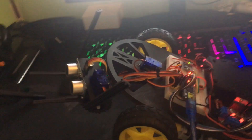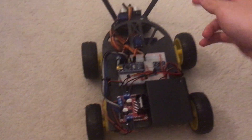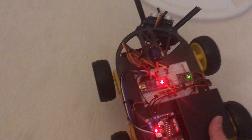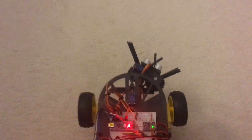With a little bit of work, I was able to make the Robodog follow pre-programmed paths. I used an IMU and basically PID-tuned it — mainly just P-tuned it. It stays on track. The idea is that it self-corrects: it uses the angle that the IMU gives and basically tells the wheels to slow down or speed up so that it can get back on course.